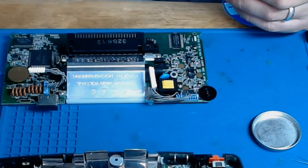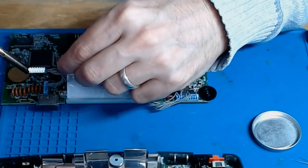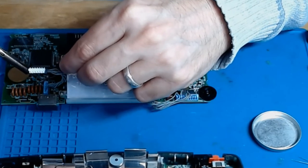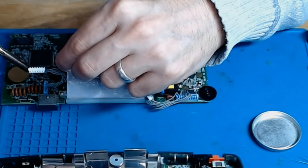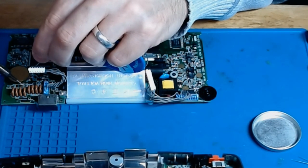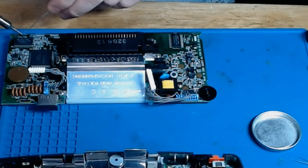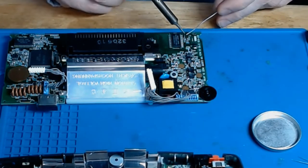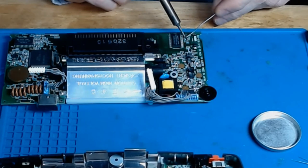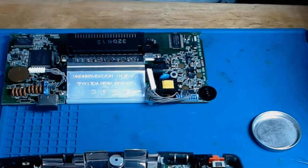The pads are completely clean of all the old capacitor legs. I'm just going to re-tin them now, ready for the new capacitors. I'm putting some new solder on the pads with a bit of tip tinner, just to get a nice new blob of solder on there. I'm putting some more flux on the pads - it does make life easier. Just a raised kind of mound of solder, nice and shiny. That's three pairs done.